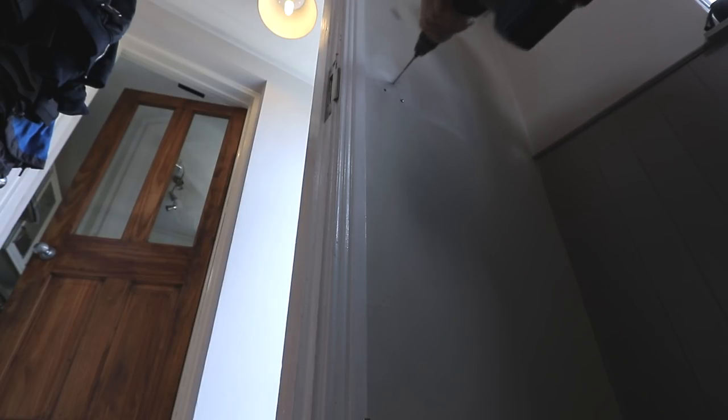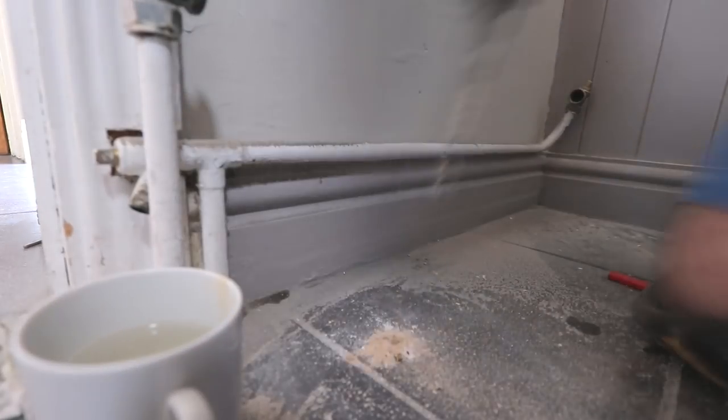So, just so you know, I've got to do 6 holes for them as well. It's not going to be fun. We'll see how it goes. Yes, the wall is going in very nicely. But in a minute, you're going to see me drill a tiled floor without tile bits. I'm going to do the old school way of doing it with a masonry bit, not on hammer.